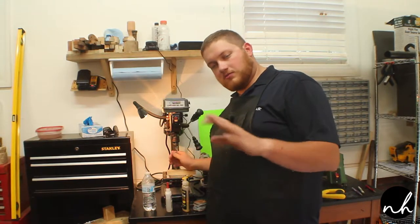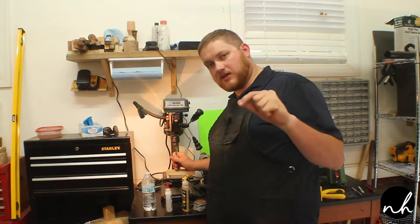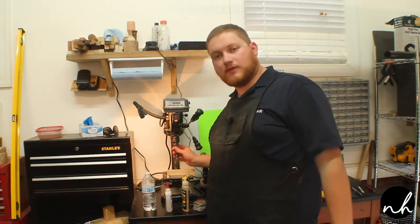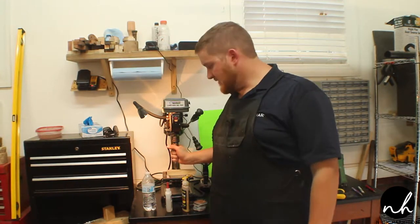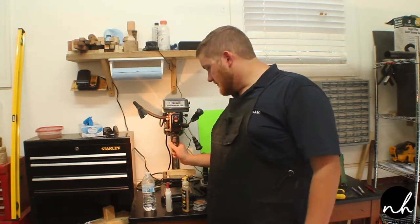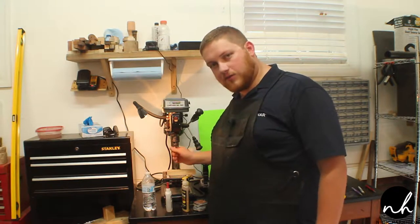Now, drill bit, normally you can find it at Home Depot or Lowe's or anywhere, but you will need a specific pen bit because a lot of pen kits are metric. So for example, if you're doing a slimline pen kit, those are 7mm tubes. You will have to have a 7mm drill bit. You can't use like a, you know, 3/8 or something different. You will need a drill bit for that.